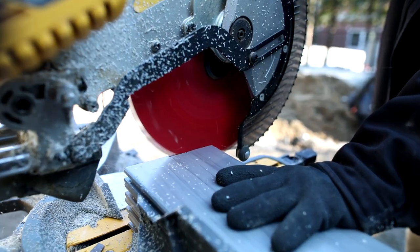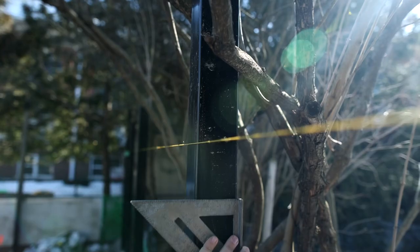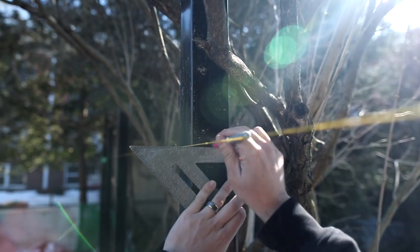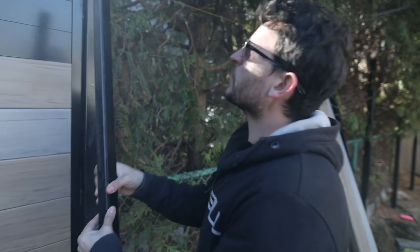To allow for expansion and contraction, you want to cut all of your individual boards exactly one inch less than your inside to inside measurement. What I do is set a string line at the top of my channel on the first section to the top of my channel on the last section, provided we're not stepping any sections, and then I use that string to mark where each individual channel is going to go. I'll use that string as a guide to ensure that all of my channels are the exact same height and level across.